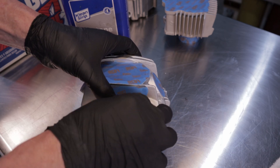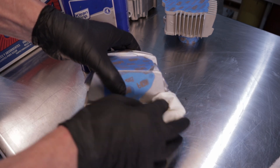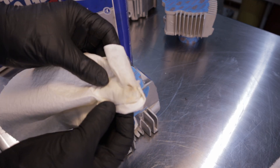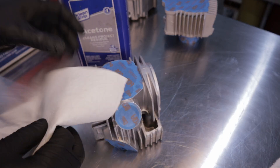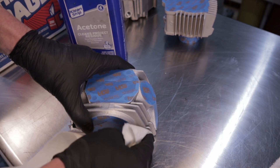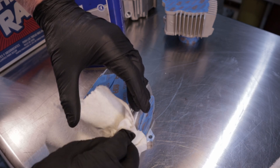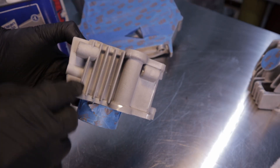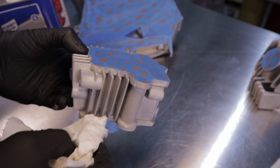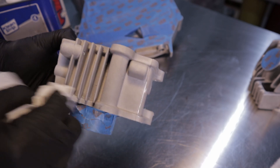Anywhere that you have done masking, your fingers have touched — and those are always areas you want to be very cognizant of to keep clean, because if your finger's been rubbing the tape or something, you've more than likely left behind a little bit of oil. Getting inside these fins is obviously not easy — just do the best you can. On these rough surfaces, go back with compressed air to make sure none of these little bits of towel stay behind. These towels can fall apart on a cast surface, so just be careful you don't have any little bits left behind.